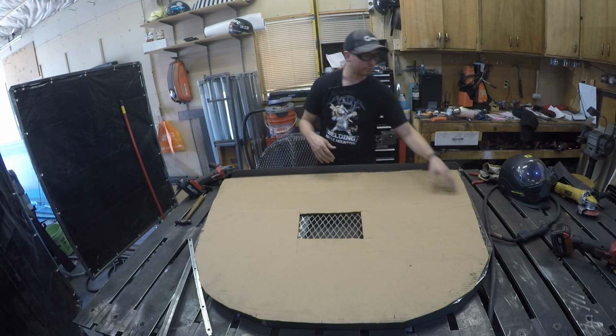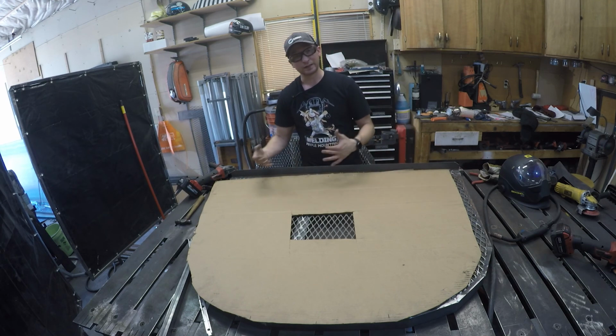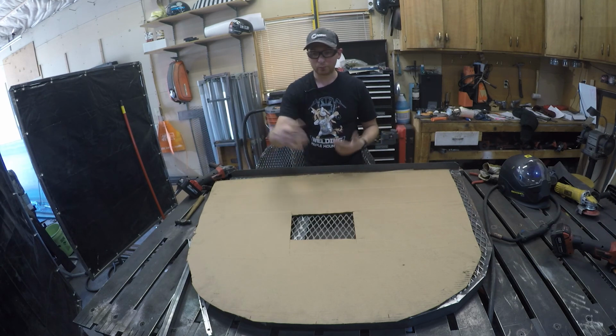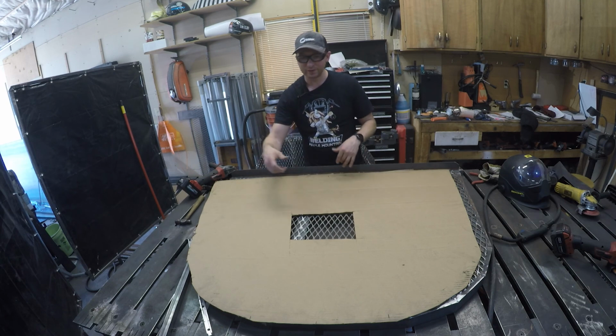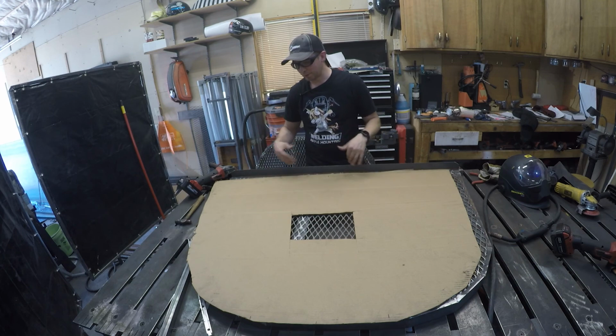I noticed a couple of mine have a little bit of a bubble on one or two that I didn't clean as well as others. So it's an extra step. On a zip wheel, you know, put up my guide, zip, zip, zip, I'm done. I don't really need to deburr anything or clean anything, but on a plasma cutter, I might go faster, but then I gotta come back with a flap disc or a grinding wheel and clean those edges back up.